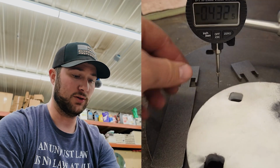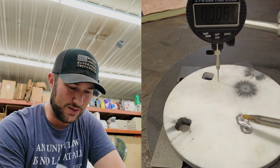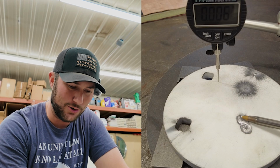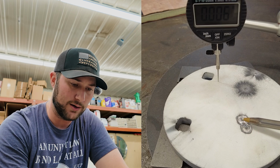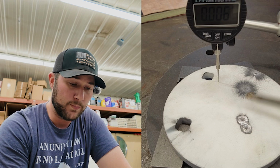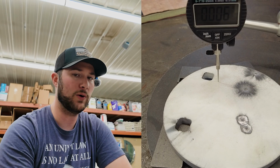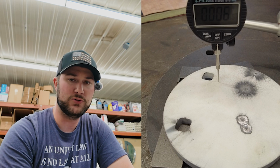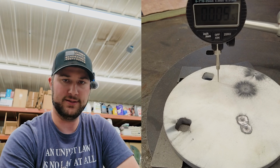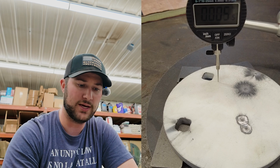So that's what you're looking for when you're shooting your steel targets. If you have them freshly painted, and you shoot one and you don't see any flowering around the bullet impact at all, you know you've made a crater and you're too close. So obviously you're better off if you can start out further and work your way in gradually and see what you're doing. I wouldn't expect you to take your chronograph and set it down range and test exactly what velocities you're seeing at the target.